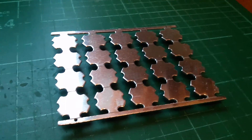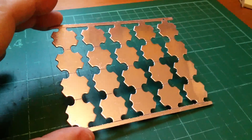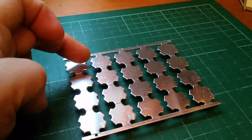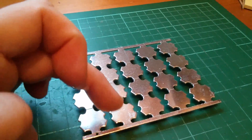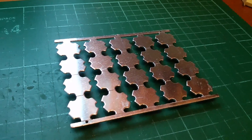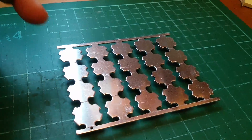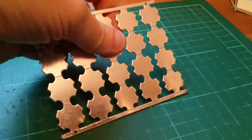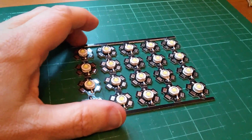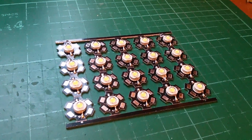It's quite interesting how these are presented. They're obviously manufactured on a continuous strip of aluminium, and then this section here is die cut — punched out with some sort of special shaped punch. You can see that there are score lines put between the LEDs, and then it's simply a case of bending this backwards and forwards a few times.